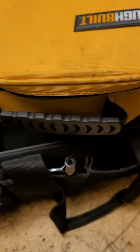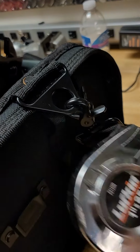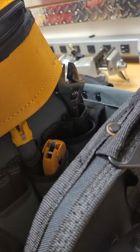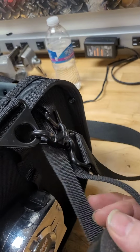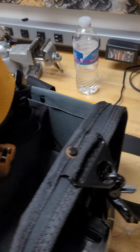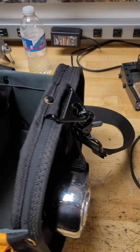All right, let's continue on to the back side here. I'll put everything away a second. He's got a nice clip here. Someone threw this away. I acquired it, fixed it. Mine now. It's got plenty of room here for electrical tape. Sometimes I'll have 3 more rolls on here for when I do 3-phase work. Orange, brown, blue, or red, brown, blue, depending on which is available, orange or red.